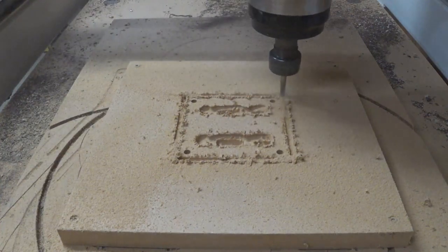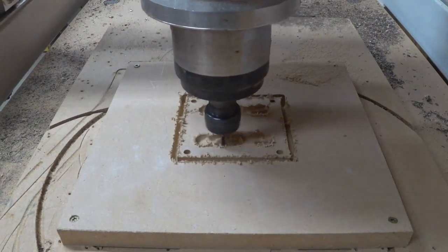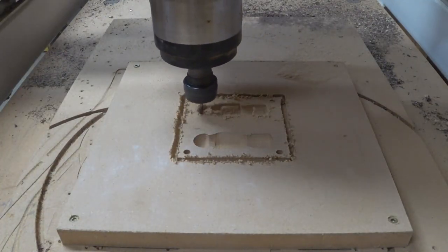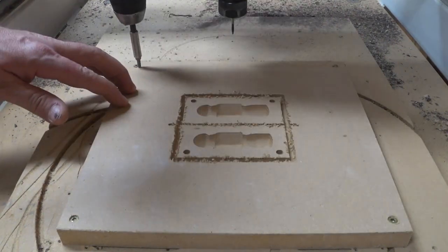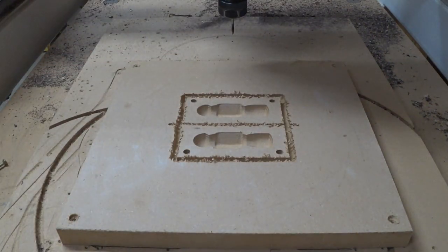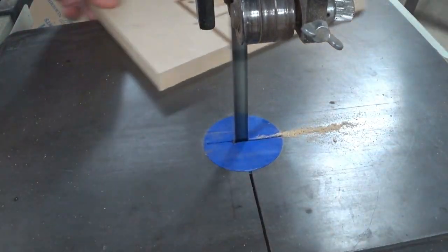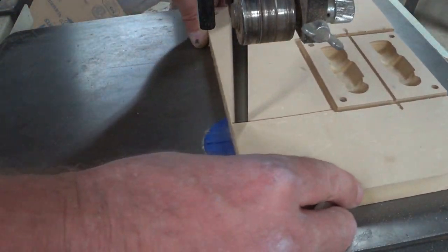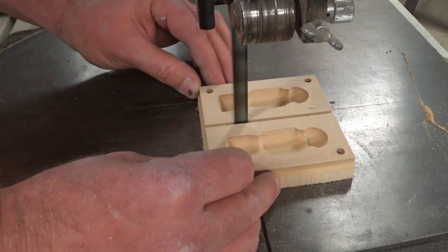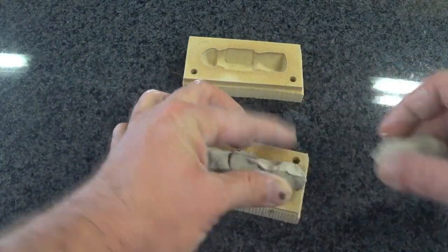You might be wondering where you get the model to make a hammer, and in truth it was not easy. I thought I could scan an existing hammer, but I could not get it to turn out the way I wanted. My last resort was turning to Tinkercad and assembling it using common shapes, and it turned out pretty good. The holes I put into the 3D model were intended for alignment pins — in the end I didn't use them, but alignment pin holes on a match mold plate are very difficult to add later, so if you think you might need them, put them into your model and cut them at the time.